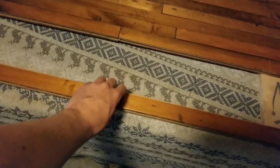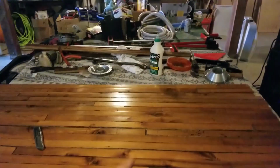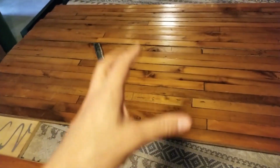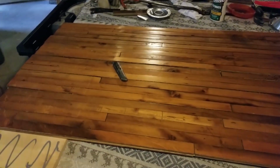Okay, so I put a little bit of adhesive down on both of these boards. These guys are all loose. This one's the only one attached, and now I'm going to start systematically bringing them one row at a time with the Tight Bond wood glue right there. Running it into the groove, pinching it together, and then continuing down until all of the boards are on here. And then I'm going to grab the vise clamps and clamp everything together nice and tight.